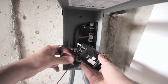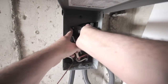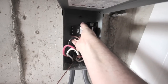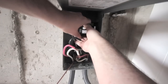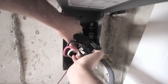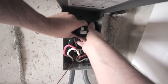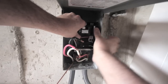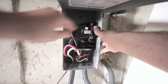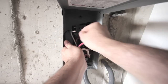You can either put these all in now or I'm going to try putting the breaker in first. You just hook this part of the breaker — there's a little hook there that goes onto the plastic piece from the box — and get it lined up with the prongs on the back and shove it in.